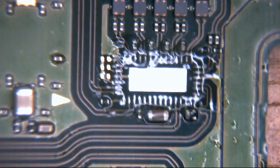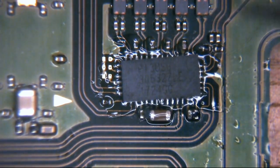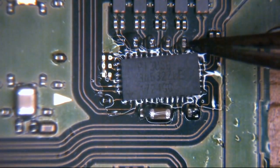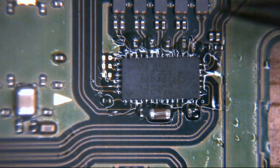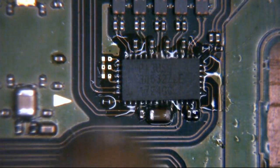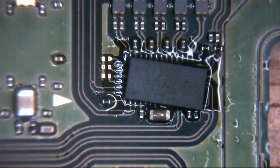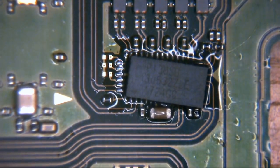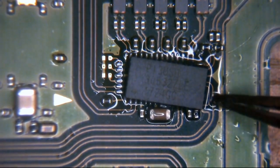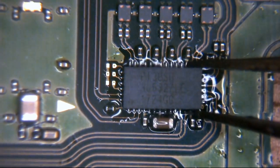Excellent. Now, as I say, because these boards are fairly small and because they're fairly thin, surface tension is quite easy to invoke on these boards to get them to go. All we need to do is make sure that's somewhere close to where we need it to be. That's pretty close. So I'm going to come back in now with the air wand. I'm going to knock the airflow down slightly. I'm going to go to 75 litres. I don't want to lose this down the air chute. That would be a disaster.